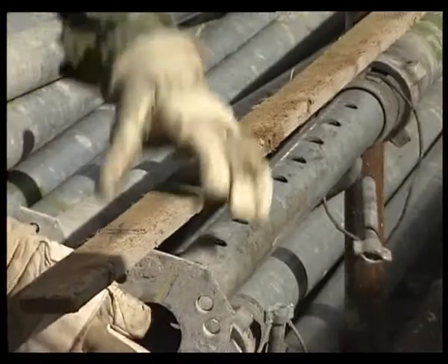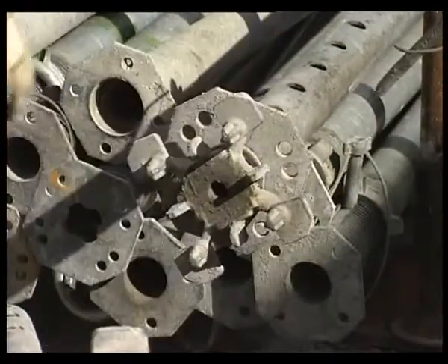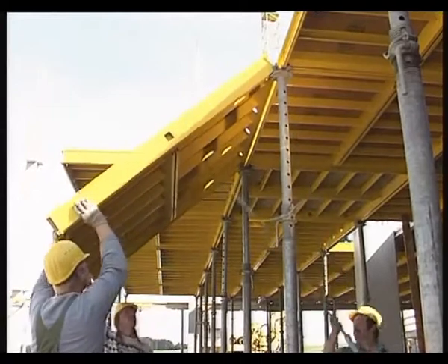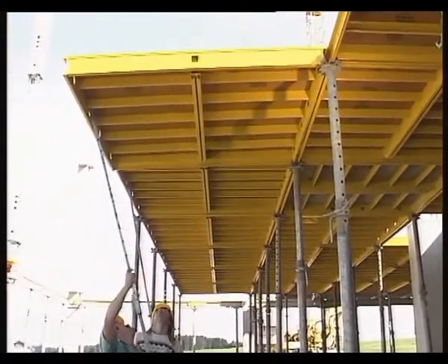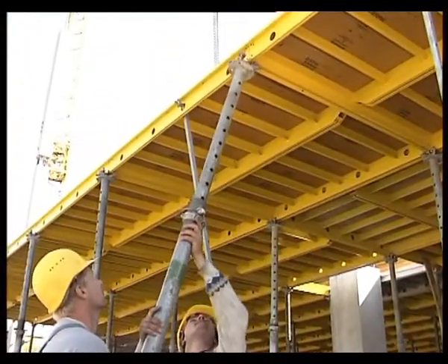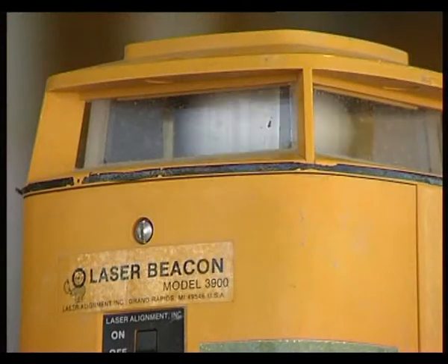The props are adjusted to the right length, and the Topic bearing is inserted. Attach the panel, lift it up, and support it with the erection rod. Stability is assured by the head support prop. The Turbo Topic panels are positioned length and crosswise, right up against the walls, and a single prop is all that's needed. Additional support is provided if the Turbo Topic panel is wedged against the wall with squared timber. The props are finely adjusted with the 360-degree laser.